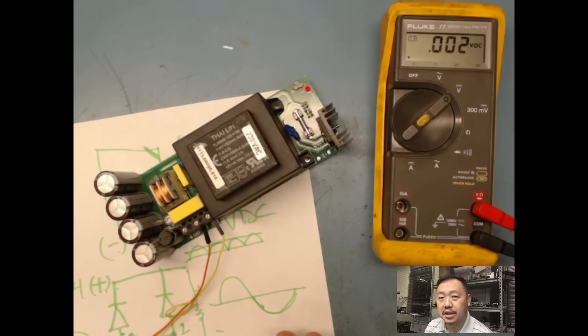And when I pull the data sheet on it, I could use my oscilloscope and check my output if it's like a flip flop or something. Without having a schematic, I'm just looking for any kind of output. Is it right? Is it wrong? I don't know. But if it's dead, it won't give you any output. If it's a simple one, you could inject a signal in using a function generator, scope your output, and see it change, and more likely it's good.